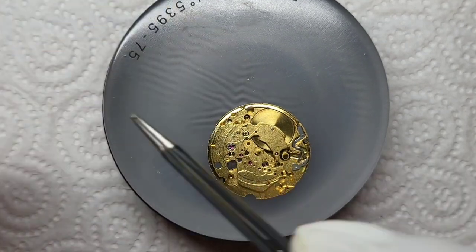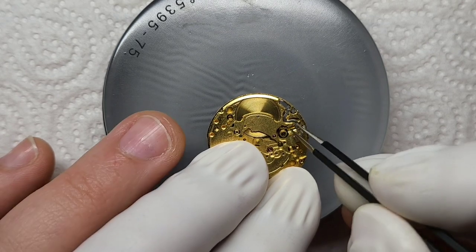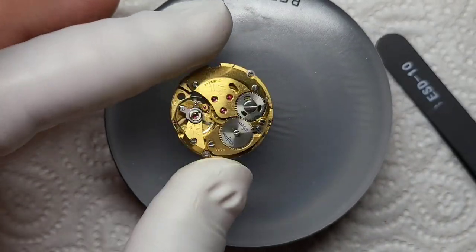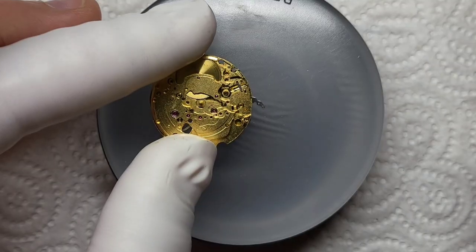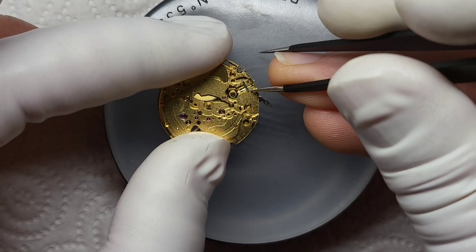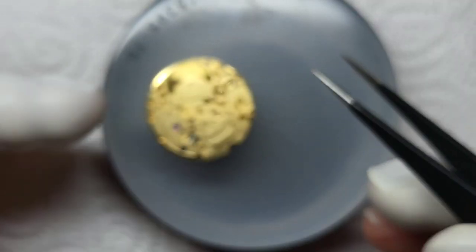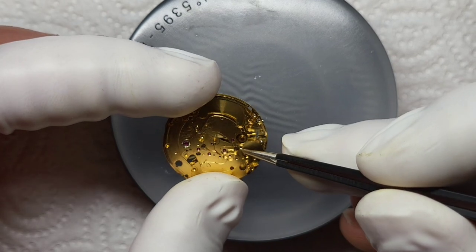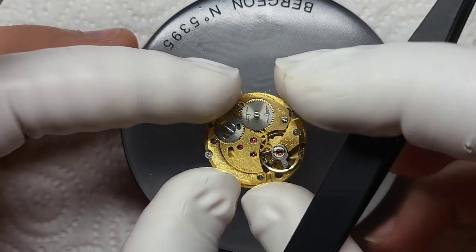This spring-loaded section puts tension on the main barrel of the keyless works — when you wind it and pull the crown back, it allows the ratcheting effect to come over. Turning over the watch, we're going to remove that final screw which clamps down onto the stem to prevent it falling out altogether. While undoing that screw fully, that releases the little mechanism. I'm coming back to have another go at that spring which is set into the chassis, but I can assure you from future proofing that it's not going to come out.